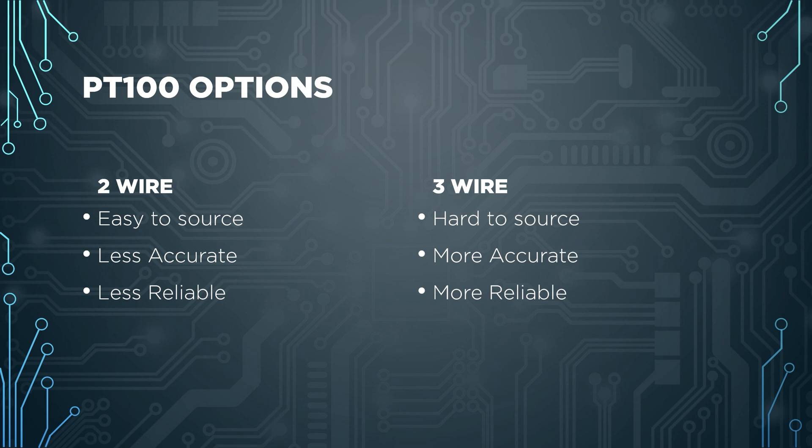The second thing to keep in mind is the wires and cable are really thin — probably something like 30–32 gauge. They're ridiculously thin, which isn't a problem for the sensor but makes it really hard to strip the cable and crimp connectors. Leave some slack on the cable so when you accidentally cut it you have some spare. Also, while the cable is shielded, it's not terminated into any plug, so if you want to use the shielding you'll have to do it yourself. To my knowledge this is the only option out there.